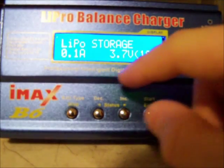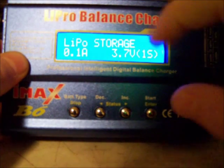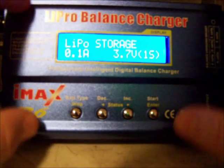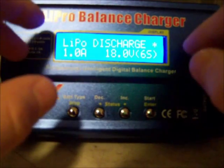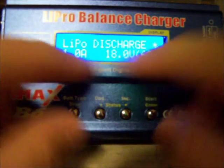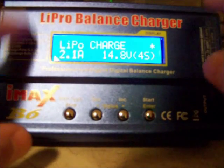Let's go over LiPo storage. This really has nothing to do with anything unless you're actually going to put your LiPos away for a couple months through the winter or something. Basically, what you do is plug your LiPos in here and it completely discharges them — runs them down to nothing — so you're not keeping that voltage in there, because if you put a LiPo away and don't use it for a couple months with a charge on it, you can damage the LiPo cells. You also have LiPo discharge. LiPo discharge is good because when you're done using your battery or putting it away for the night, you always want to discharge it. If you keep a charge on it and something malfunctions, it can go off. If you take all the juice out of your battery, it just makes it so it cannot go off on you. And then you're back up to LiPo charge, which is what I would usually use.